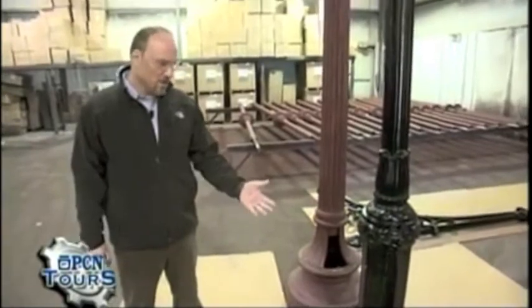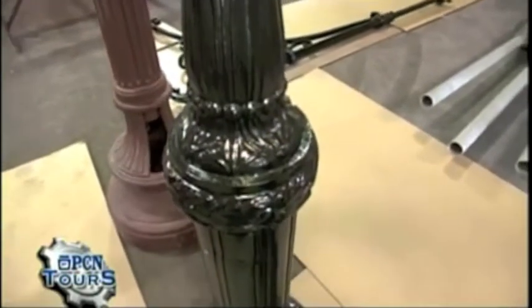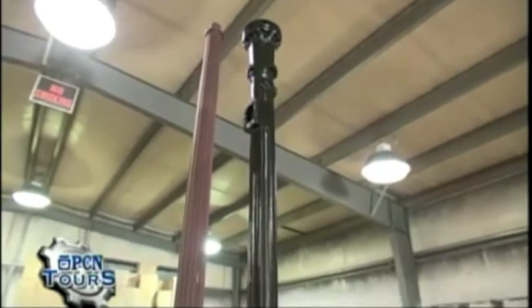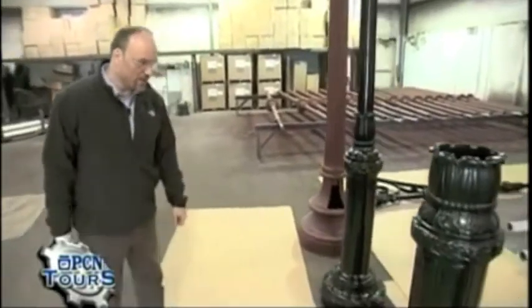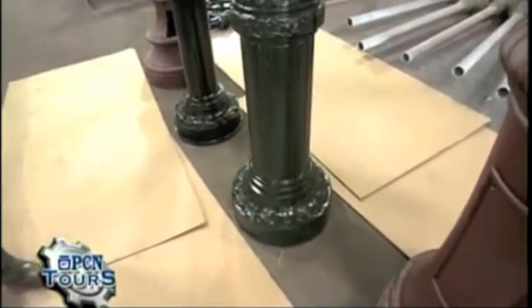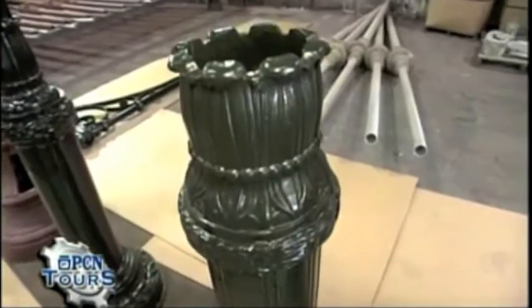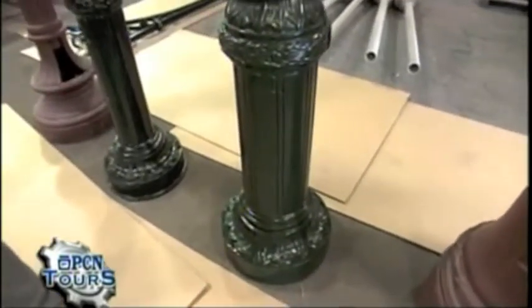This particular post is one of my favorites — it's a Madison pole and you can see how decorative it is. You'll see these poles in Central Park, New York City, as well as the streets of Royersford, PA, and this particular setup is going to Lansdale, Pennsylvania. The base next to it is kind of its big brother — you can see similarities in the style. This base goes to the city of Norristown, Pennsylvania, and it wraps around the steel shafts as we talked about at the fluting machine. It's actually a two-piece casting that wraps around that steel shaft to give it its decorative look.